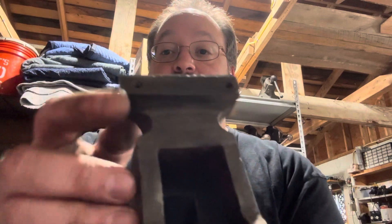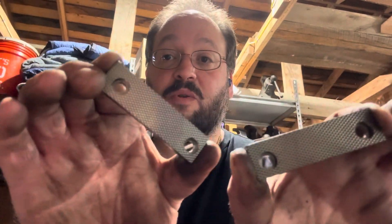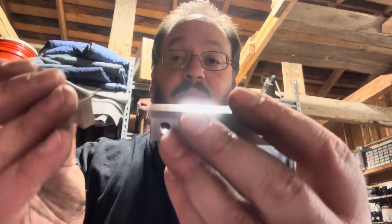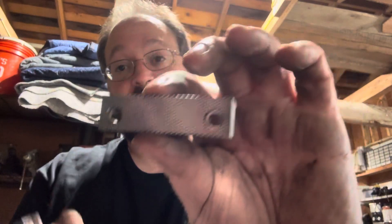This particular model is set for removable jaws, so those are tapped and drilled. Logan is an incredible machinist — I'm going to tag him in this video from Kendrick Machine Shop; you should check him out. If you need parts for a vise, especially jaws and some other hard-to-get parts, he does make them. Here I have brand new A2 hardened tool steel jaws which he did inscribe for the dynamic and the static, as they are not interchangeable because they are off a little bit. These are brand new, incredible work — they will last another 100-plus years, with classic vise knurling. Not too heavy, but will give an incredible grip.